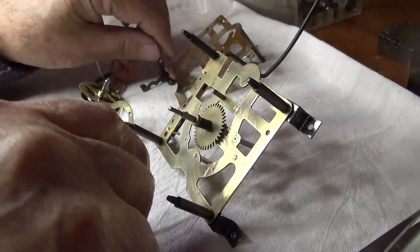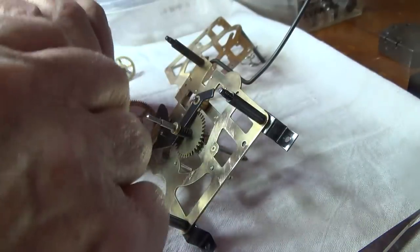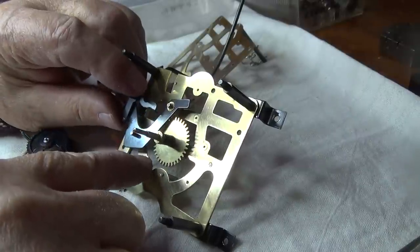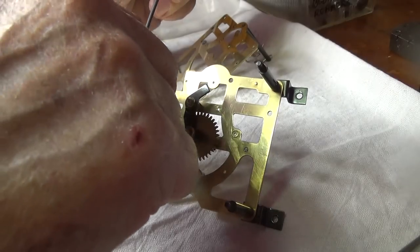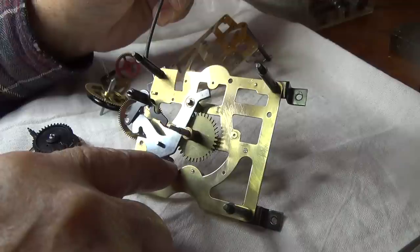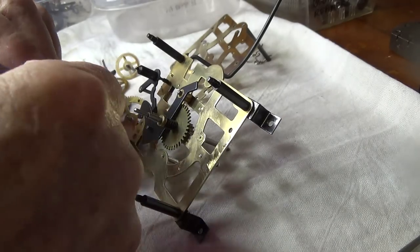And there are two pieces of the lever types that we have to keep and put on the inside before we put the plates on. This has to go on here. That's what keeps that door open. And then this has to go. So this lever can get on that like so. All right. We have to remember before we close the plates to turn that little flag on the inside of that pin, like so. That's got to go like that. And then this will keep the door open. Okay, so that has to go in first, and now we'll put that E-clip on there. Here's the E-clip.